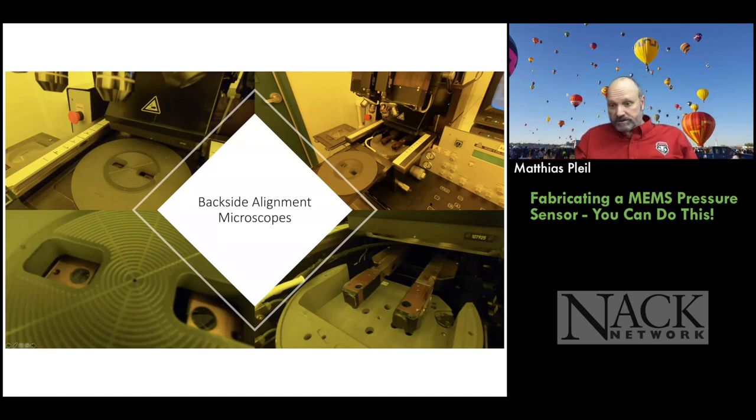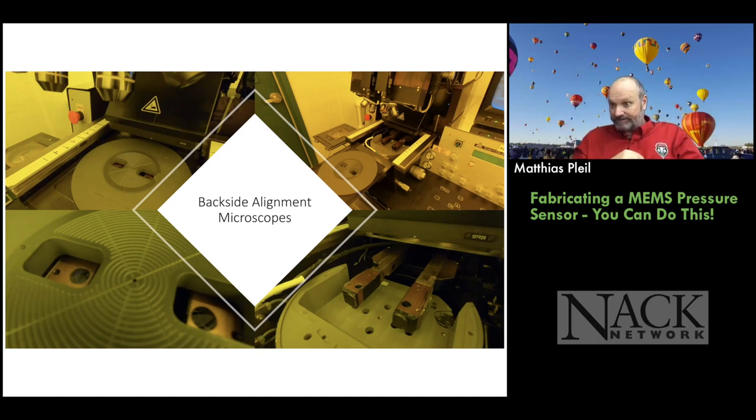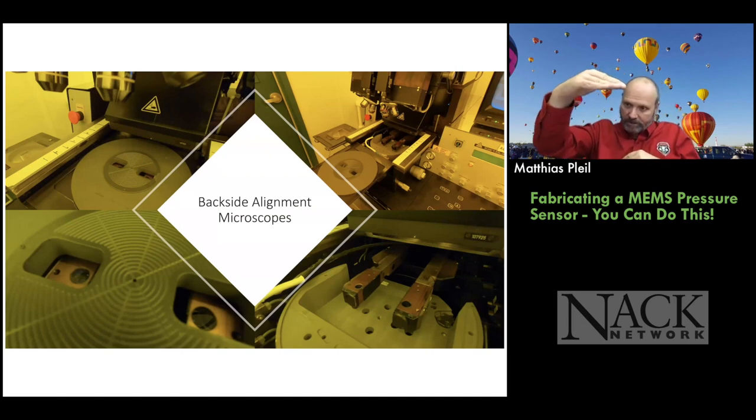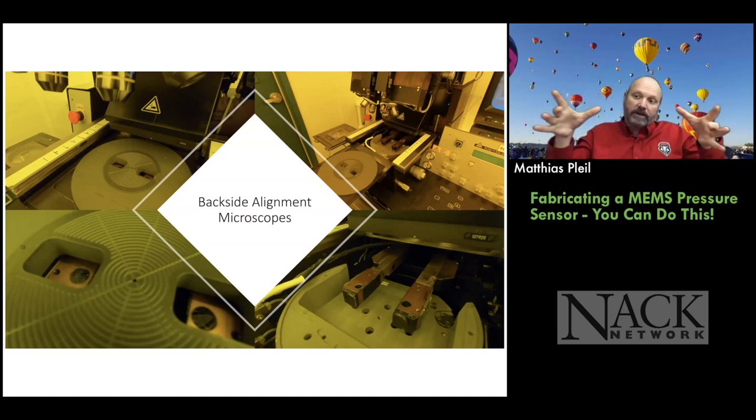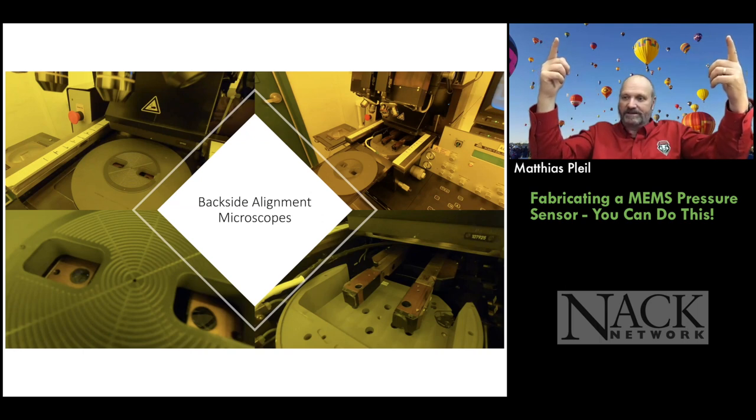So these are pictures of the alignment microscopes underneath where the wafer is going to be. On the bottom right here, you can see a close-up of it. And these can move in X and Y. So what you do is you're going to put your mask in, and then you're going to look up and align the microscopes to the mask. Then you're going to not move the microscopes, and you're going to put the wafer in between the microscopes and the mask and move the wafer till it's aligned with the captured image from the mask that's going to be on the top side. Now you know you're aligned.